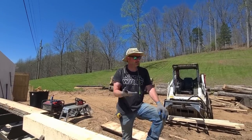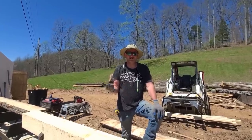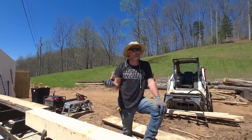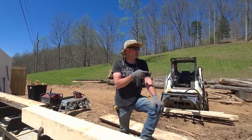If it is, then go ahead and fire off your command. Now, as a human being, it doesn't seem like there's a delay at all, but the computer just counted up to 50 to ensure that the button was still pressed after that 50 count. And if it is, then do the action I request you to do. So that's what I did, and it has fixed the problem.